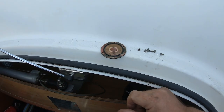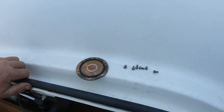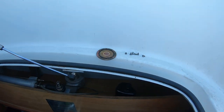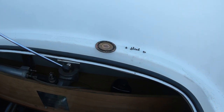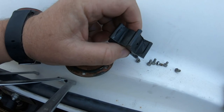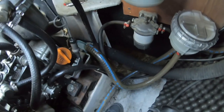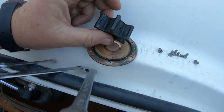I suspect it's not that badly worn, because this being the starboard engine, it doesn't get run as much. It's probably got about half the hours that the port engine's got. That's because the port engine does the hot water and prioritises the batteries. Right, let's get that out and show. Right, so this is the impeller that came out, and it promptly then flew straight off the front of the engine and down into that dirty old bilge water down there, where it was almost impossible for me to get out. So let's have a look.